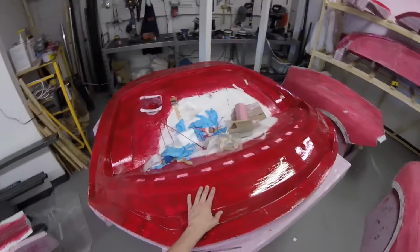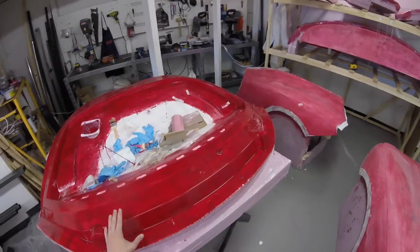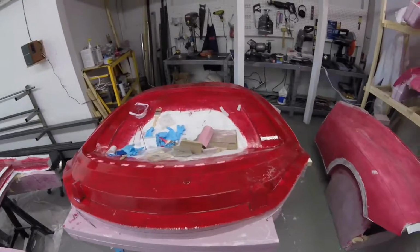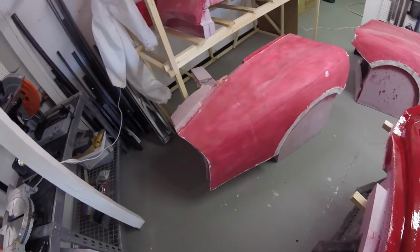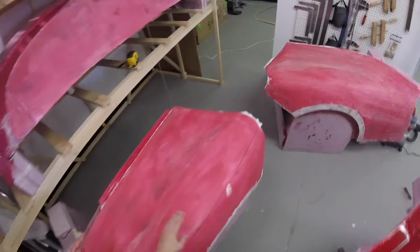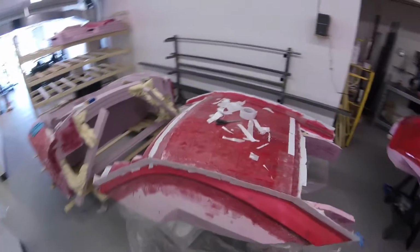So the windshield mount is ready. I put epoxy on the last section. So this is ready to tape out the edges and spray it and then lay out fiberglass for the mold. And later today I'm gonna sand this drywall fill on the quarter panels and then put the separator and then do the taping and washing and PVA and wax for these parts. So I'm gonna make these, this, while this is curing, and then get back to the sides when it's done.